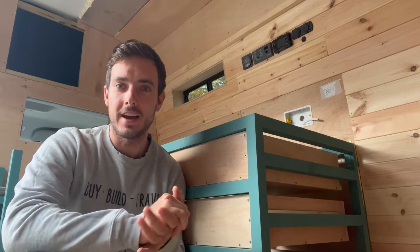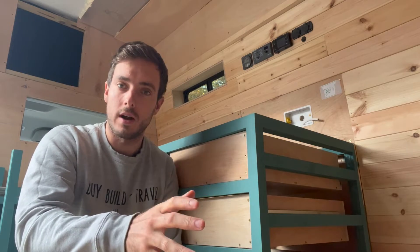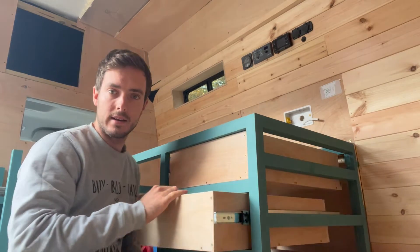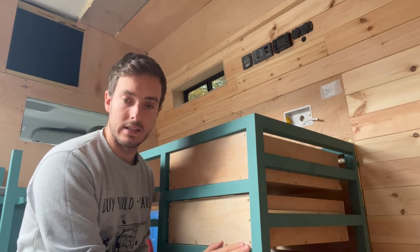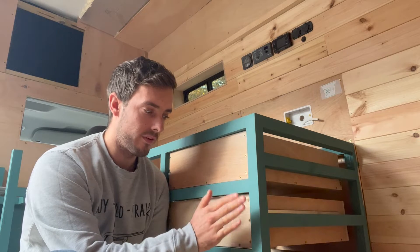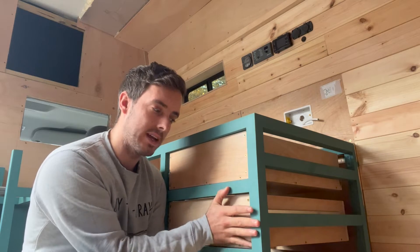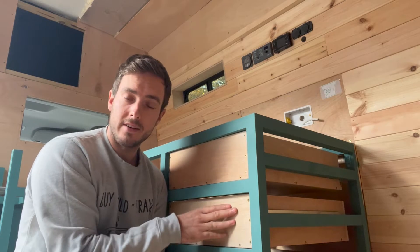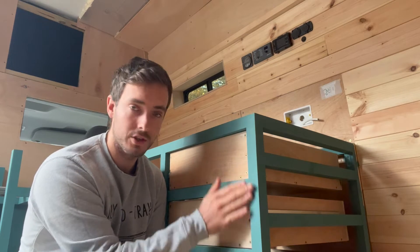Hello and welcome back. I'm in the back of a very cold van today, and I want to talk about drawers. I actually installed these yesterday but installing them can seem quite tricky, so I want to talk you through how to install drawer runners. These ones have already been made and installed with the spacing sorted out. These drawers have been inset to the cabinet by 18 millimeters. You can either have flush mounted drawers or face mounted drawers. For face mounted, you bring the runners out level with the edge of your frame. I want them inset, and since I'm using 18mm material, the face will come flush with the kitchen frame.